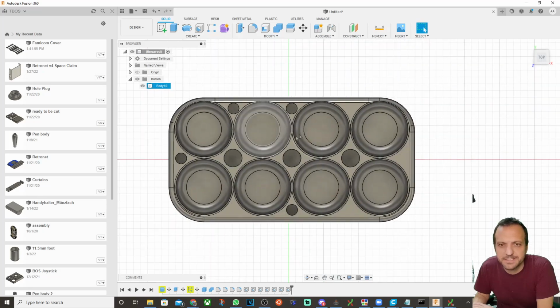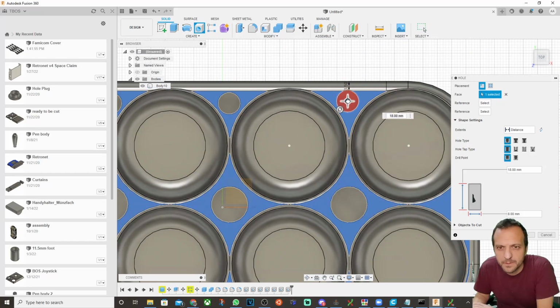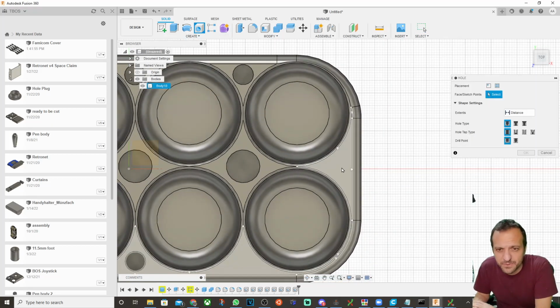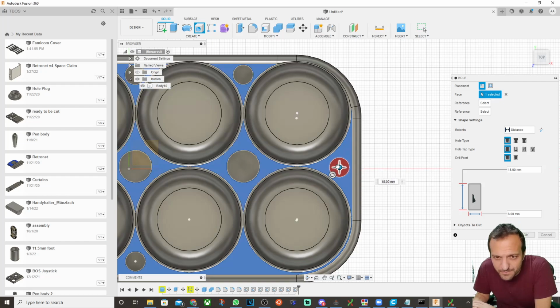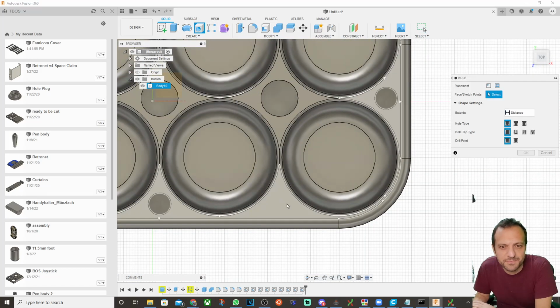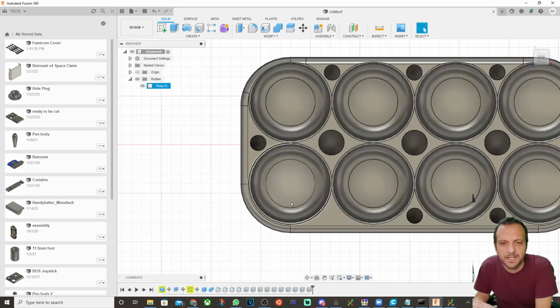I think there's a slight issue in when I placed the original cylinders, but it's okay. Again, stuff like this, often you won't see it in the print because you've got to look at the tolerances here. You're often working at much tighter tolerances within your CAD package than your printer is capable of, so don't sweat it. Because you see here you've got lots of room around the hole, whereas on the top ones you get a lot less room. It's fine. And here's the last one.